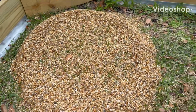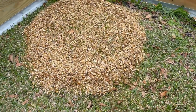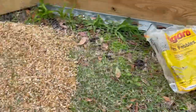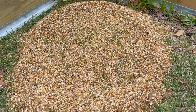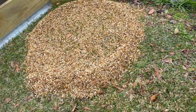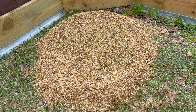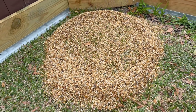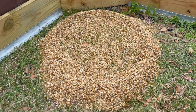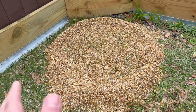Today we're making one of them tortoise ponds — a little swimming hole. We got some pea gravel, that pea pebble, made like a dome shape, kind of low in the middle and high on the sides. We're going to go ahead and pour some mortar mix — just the dry mix on the rock — and wet it to kind of set it in place. You can do this with cement, mortar, or thin set. We'll come back once that's dry and show you how we're going to coat the whole thing.